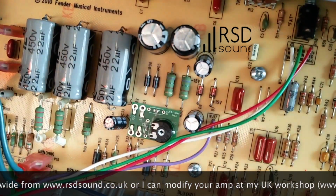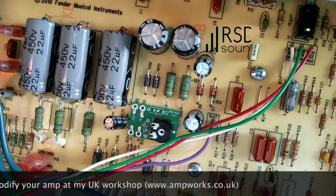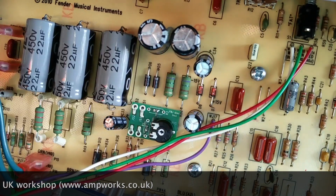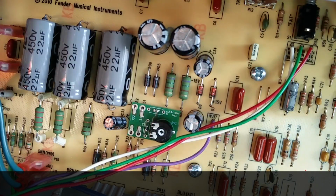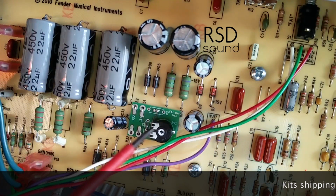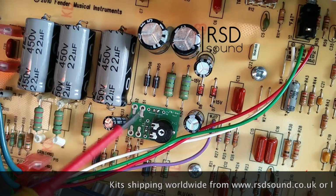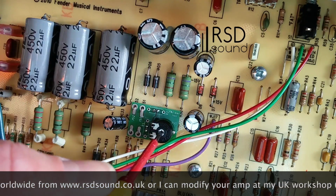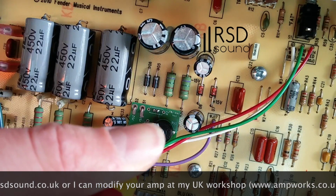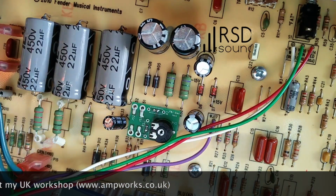Depending on which way you like to do it, I like to use a Noval adapter on the EL84 to measure the current coming through the cathode. Hotter bias is anti-clockwise in this particular one, so you turn anti-clockwise to turn up the bias. So obviously we'll start by turning clockwise. Have the bias as low as possible when we start biasing it up, and then we'll increase it to the point where it's at safe dissipation.